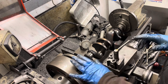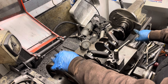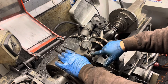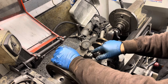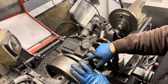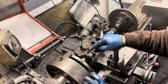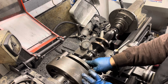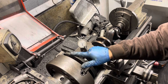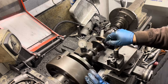I made a mistake there — it wasn't the bolts catching, it was me being silly. Basically you can only hold the sliding plate with one pinch bolt because you run out of traverse on one side, so you have to take one bolt out. But we've got bigger problems: I've obviously clocked it up in the dowel's zero position, so I thought if we're doing standard stroke the big end pin should be true to the jig — but it's miles out. I then clocked it off the outside diameter and checked again — it's still a country mile out.